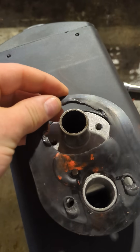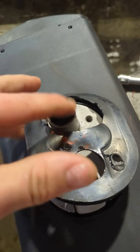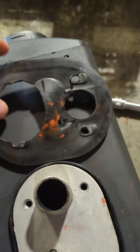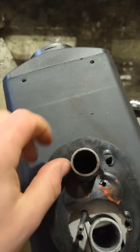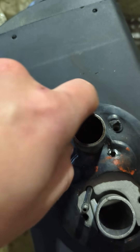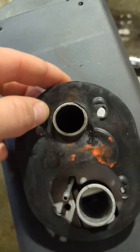I'll show you what the problem is. You may or may not have this, but there's a rubber gasket right here. When you first get to it, it'll look like this — on both sides it'll have two small holes. What happens is this thing is right up to the exhaust. This cheap Chinese plastic or rubber is right up to the exhaust, and it'll start to burn right there. It'll start to crack and off-gas and produce plastic fumes that are making you sick.